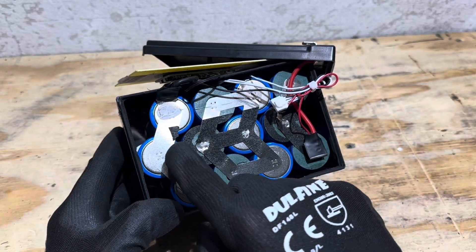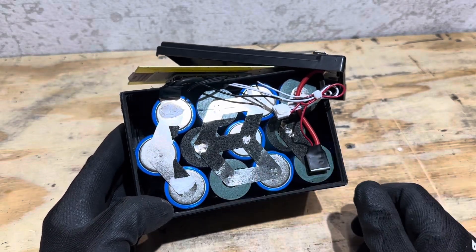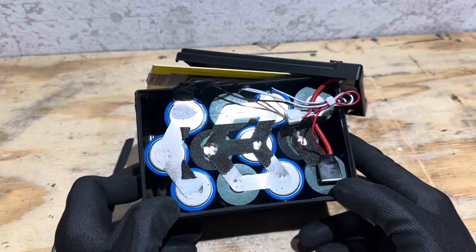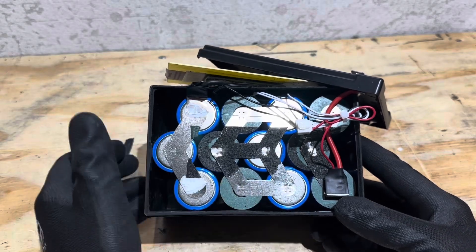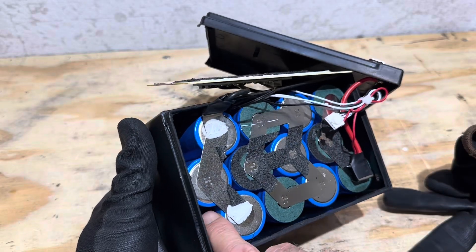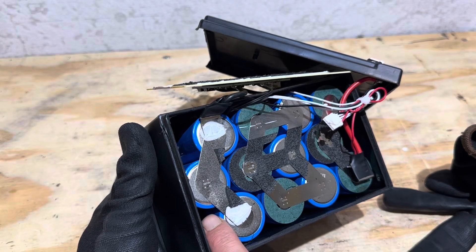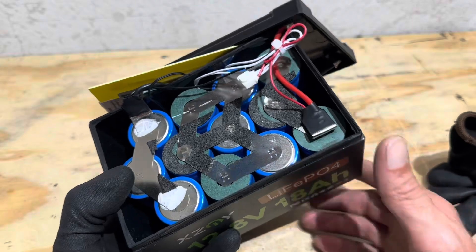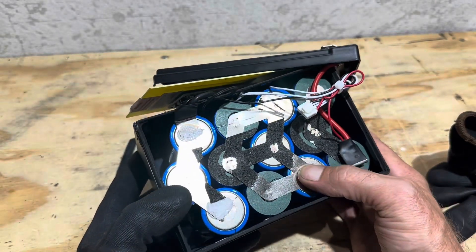I am going to take the balance lead off because the way the wires are tight and routed in there, I cannot get the epoxy board off without pulling the balance leads from the board. So there's the cell pack arrangement: cylindrical cells, groups of three paralleled together and then in series in a 4S configuration to make 12 volts. So each cylindrical cell would be 6 amp hours of capacity. I tried to get you a number on the side but I cannot really see it at this angle, and I'm not going to pull the cylindrical cells out because I'm afraid I will break the little bus bars — they're just spot welded on. The cells are rated at 19.2 watt hours at 3.2 volts — so that's right at 6 amp hours, just as I assumed. Nothing odd going on down here. The thing looks pretty good.